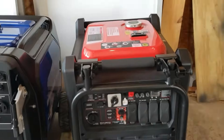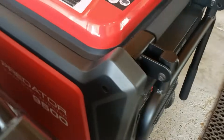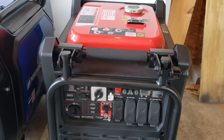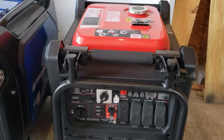7,500 watts doesn't mean you can't surge above that, but your sustained power has to stay right around 7,500. For example, this 9,000 watt generator has running watts of 7,600 — so if you're using this generator alone, use the 30 amp plug. But if you're going to parallel this generator, then you want to think about the 50 amp plug, and you'll need a parallel kit.